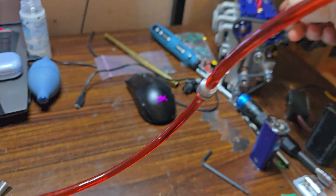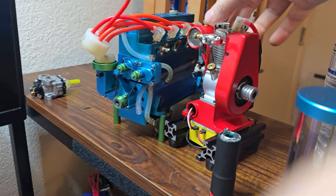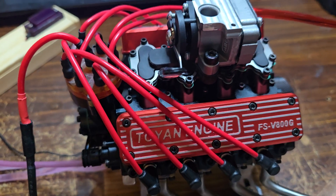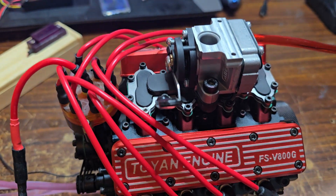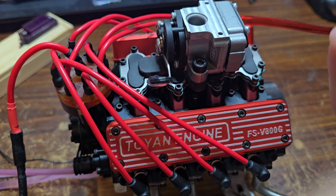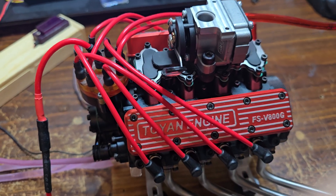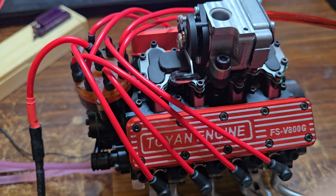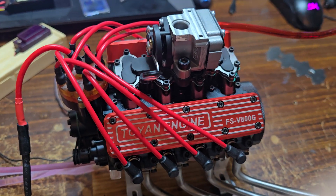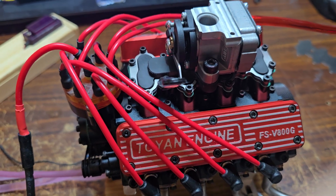Every engine I have — whether it's the D6, the GNN100, or even this little Musa — all the carburetors lead directly to the valve ports. So why they had a divider plate in here, I'm not sure. It just feels too restrictive on the fuel end and it's not letting these engines run right. I did get mine to run without this plate. Plate's not needed — get rid of it. You will have to go to shorter screws on your intake, but that's fine.